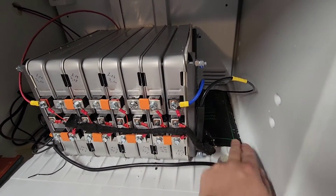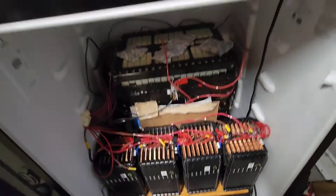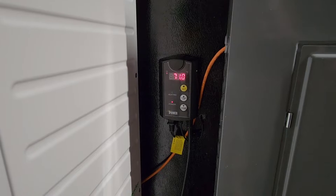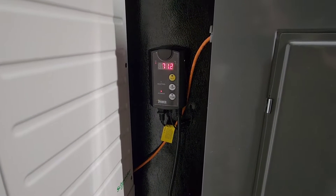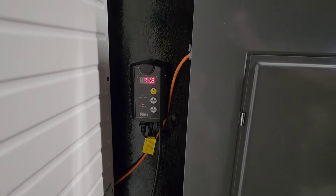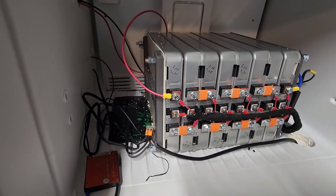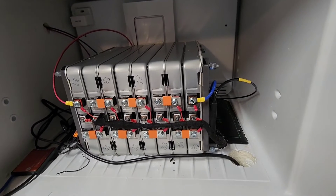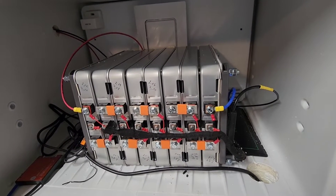Before we go over to the combiner, I wanted to show you this heater mat I have underneath here. This is a seedling starter mat I got off Amazon — I'll leave a link in the description. I have one hiding underneath this pack as well. They're hooked up to a temperature sensor hanging down in here and connected to a controller right over here — I just drilled a couple of holes through the fridge. The main reason for putting this battery in a fridge is that I live in Vermont and I don't want it to freeze. These seedling starter mats really don't get very hot — up to about 80 or 90 degrees Fahrenheit — they use about 20 watts apiece, and it's a very safe way to keep a heater inside the fridge.